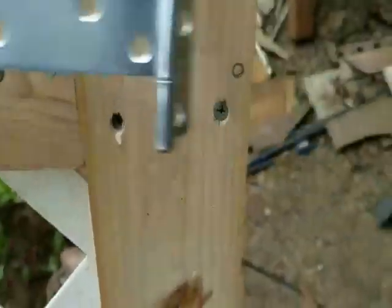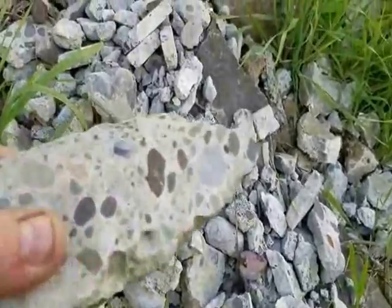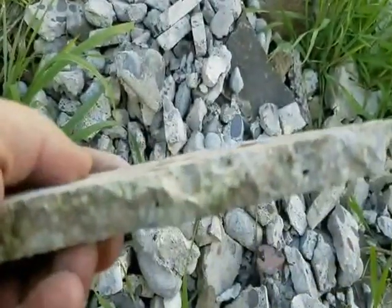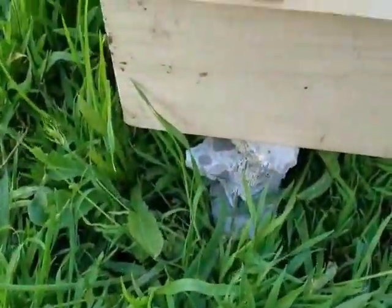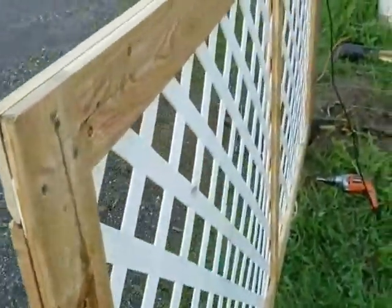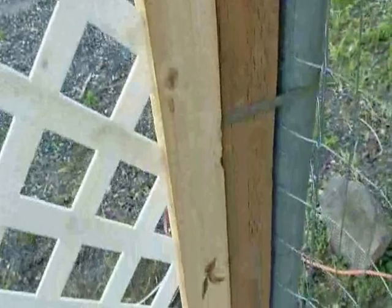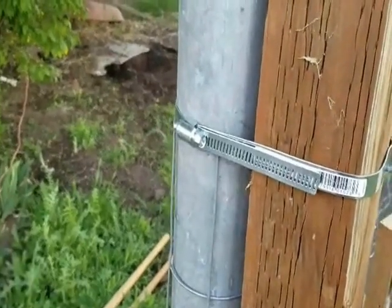So when I put it up I can just pop them in there easily. A couple years ago we cut out a window in the concrete using a concrete saw, and that made these great little flat concrete bumper pieces. I'm using a whole bunch of those to jack up this end of the gate so I can get everything nice and level before I screw it in, to make it all nice and somewhat straight. Going pretty good right there.